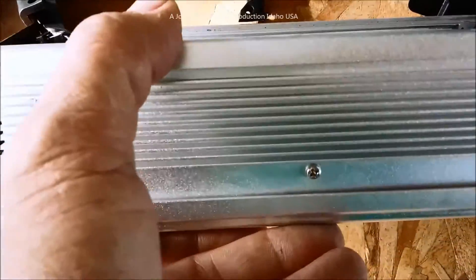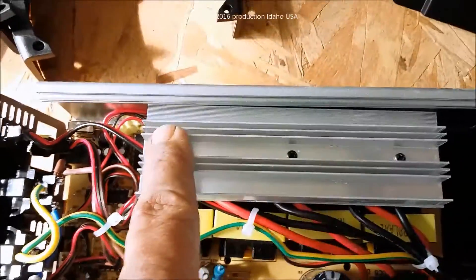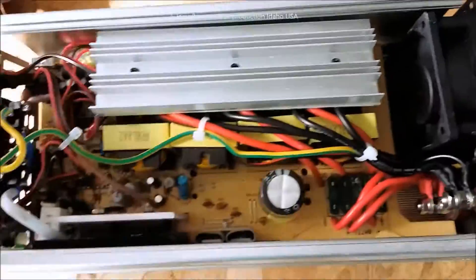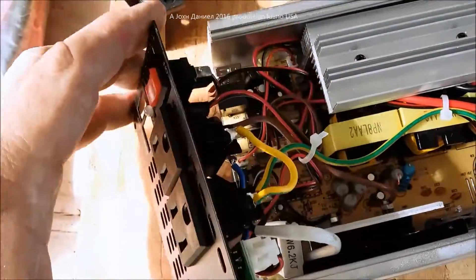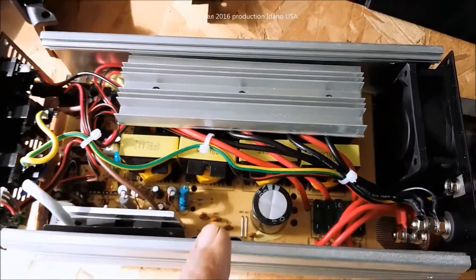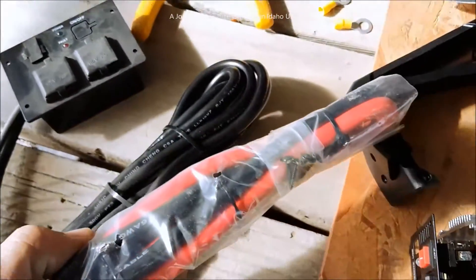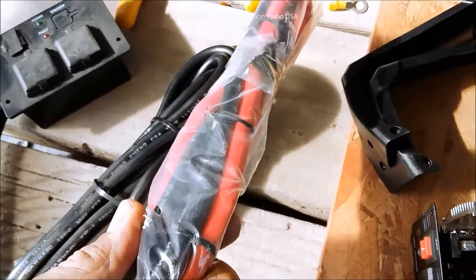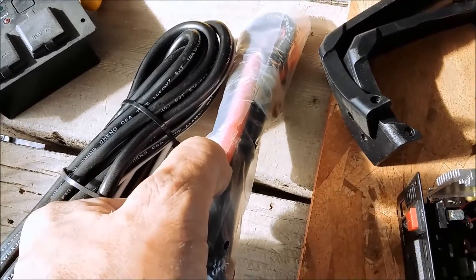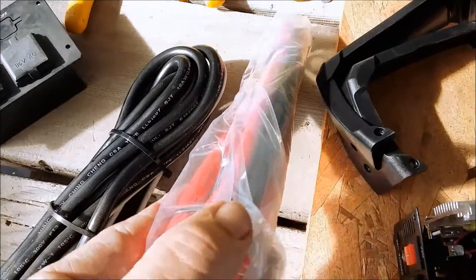This one has two main drivers and multiple MOSFETs isolated onto a heat sink with good cooling. As far as a ranking for a modified sine wave, I would put the Peak at a nine simply because I have beaten these hard and they are durable. The Peaks do come with their own cables, and yes, they're copper clad aluminum — 63 percent according to the material list, leaving 37 percent real copper.